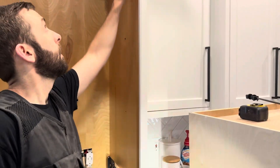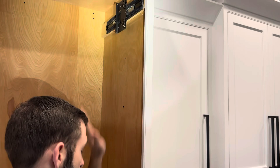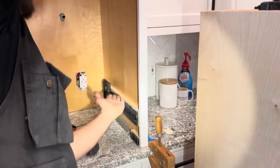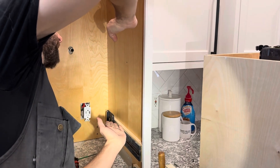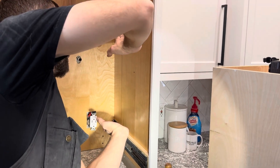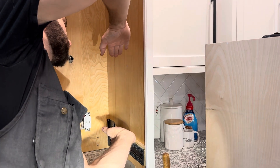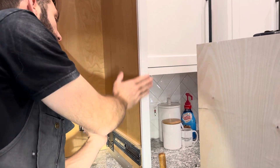For one, these need to be parallel and perpendicular. The two slides need to be parallel so they can't be tilted one way or the other, and they also need to be perpendicular to the face of the cabinet.